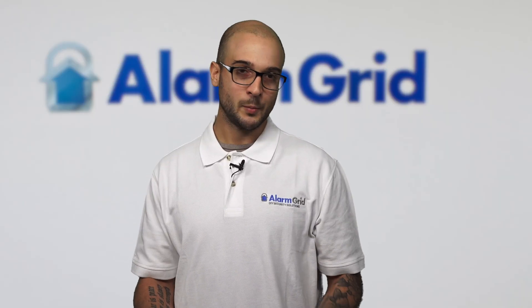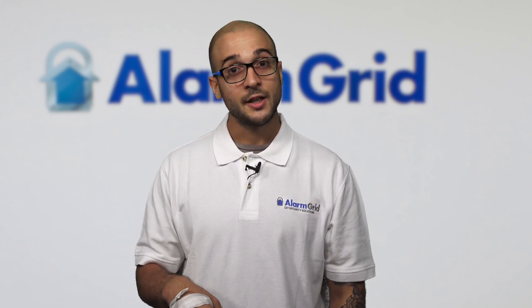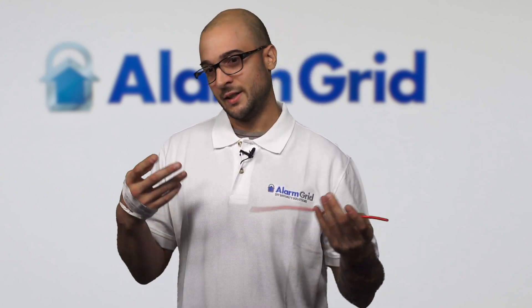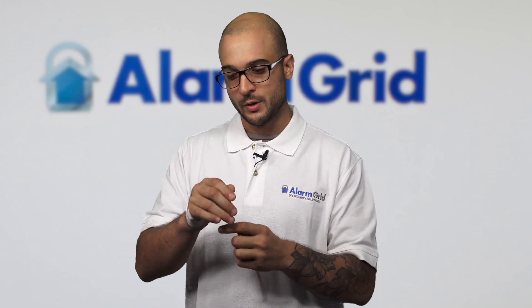This is a really convenient cable because it's set, ready to go — you can just take it out, install it, and it's good to work. If you don't have an LT cable or you want to just use regular cable, over here we have a piece of 18-4 cable. Typically you want to use 18-2, as two conductors are all you need for the power connection, but if you only have four conductor wire, it's totally fine to use — you're just going to use two conductors from it.